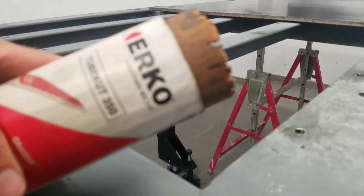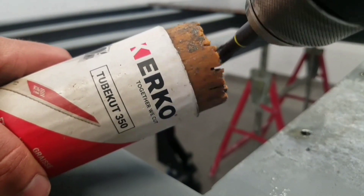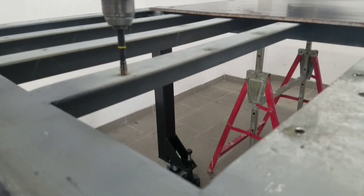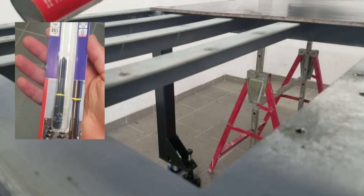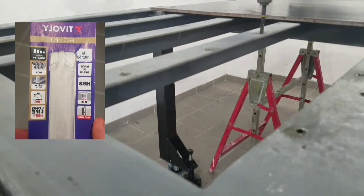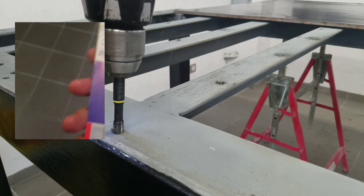Now I'll move on to tapping. For the tap, it's really good to use this cutting grease — the Tube Cut 350 I mentioned earlier — because you don't get oil everywhere, it's not greasy, it's really clean, and it lubricates very well. You can feel it in the heat reduction — it's really good. As for the tap itself, it's a Tivoli, so you can use it at a higher speed than others. I'll put a link for it too — it's really interesting. You use it with a driver in one pass, it goes great, it cuts great.